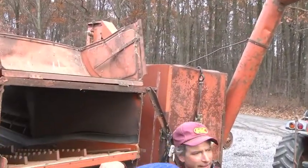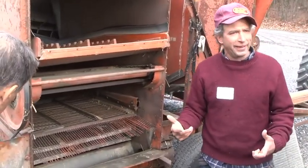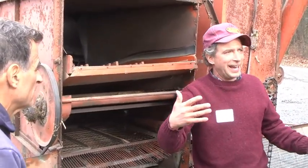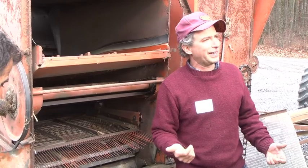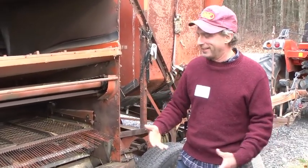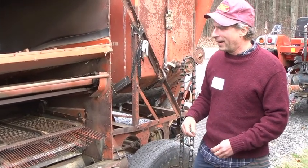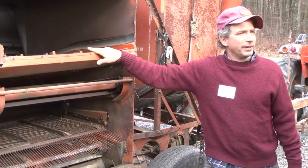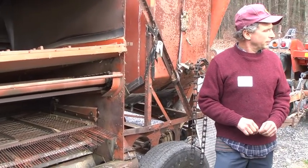gets re-threshed. All right, and so what you want to do when you're adjusting this machine is, you can set this bottom sieve way down and you'll get tons and tons of tailings returns, but each time you thresh the grain again, you've got more of an opportunity, A, to lose it out the back, B, to break it or damage it, and C, you decrease the capacity of the combine because you're threshing everything twice. So the trick with a combine is to get this all adjusted so that you're always going to get a little bit of tailings return, but not so much that you're decreasing the grain quality or the capacity of the combine, and also that you're not losing too much out the cleaning shoe and or the straw walker.